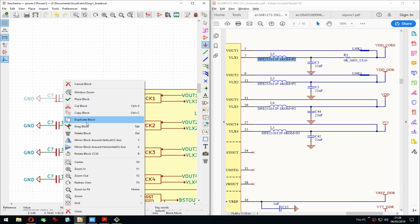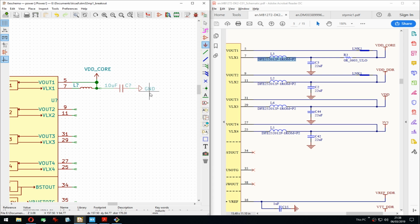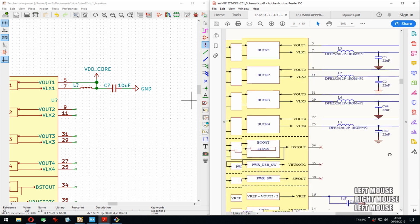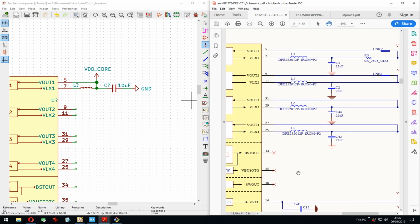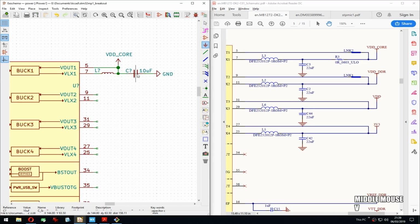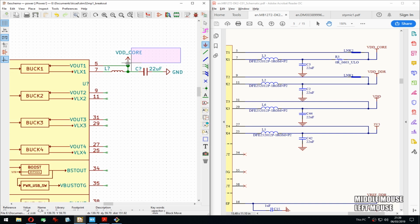But yeah, I'll be the first to admit that sometimes it's confusing trying to find replacement parts, because if you don't 100% understand the significance, I mean, this is an inductor for a buck converter, but it has so many parameters, and which ones are important? I'm still not 100% sure what that resistance does in inductors. So is that value important, or is it enough if I just buy a 1 microhenry with like 4 amps? I'm not sure how precisely I should match these specs. And I mean, I have some holes in my knowledge. I'm trying to fill them in, but it's not always so easy.